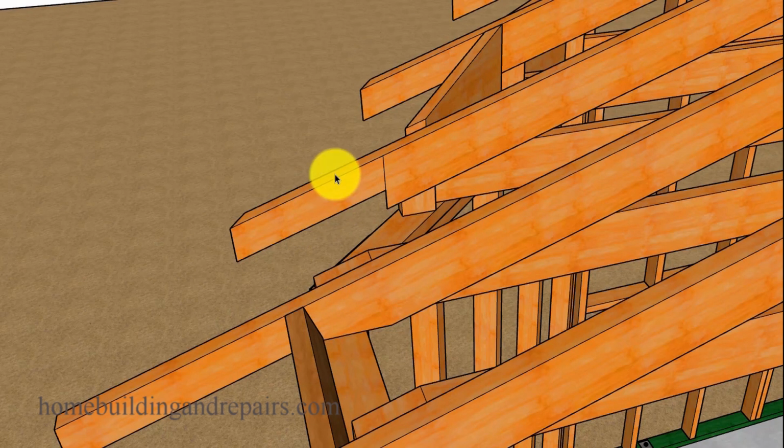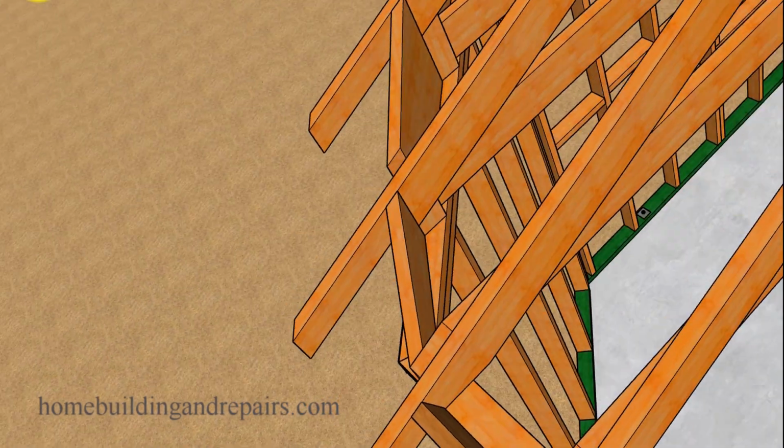This is all something you can do with these reference points when you are shaping the rafter before you install it. So put the rafter in. You're going to use some screws to attach it to the ridge. Maybe use some screws to temporarily attach it to a board, maybe the ceiling joist, even the straight edge to prevent it from moving. And then you could mark everything out, pull the board down, and cut everything that you need.